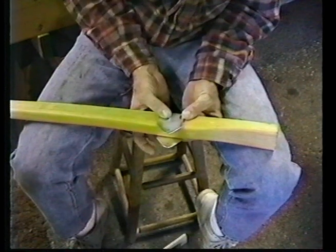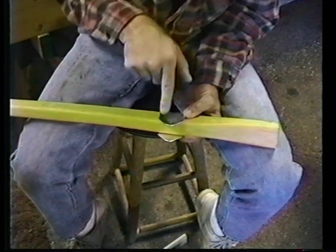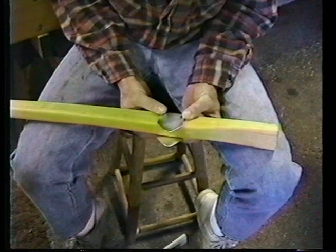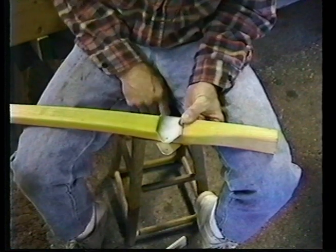And then an AN-525 bolt, or AN-4, I forget the dash number, will go through the center of this as well. Then this will all be reamed out to size to a 5/16 inch bolt. We'll be back to you when we actually get ready to set up to sand and do the bonding with glass on this exterior surface.